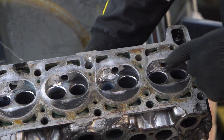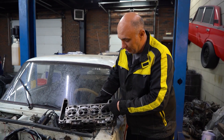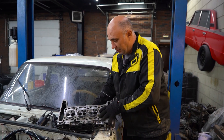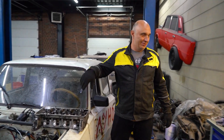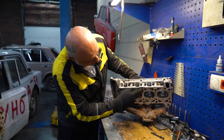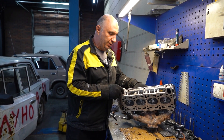While we were welding these plugs in, we scorched a couple of the valve seats. We were unable to grind that out, so at least now we have experience. This didn't work the first time, but we've slightly shifted the orifice. On the head we're using, there's going to be more separation from the seat — the welding we did on that one is good. One cylinder head will have to go to recycling — or maybe we'll recast it into something. With this one, we made use of our experience. You'll see we have four plugs going through the water jacket, welded on one side and on the other where the combustion chamber is, so no pressure will leak.